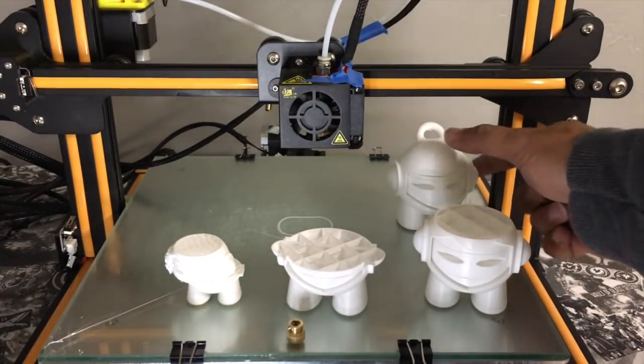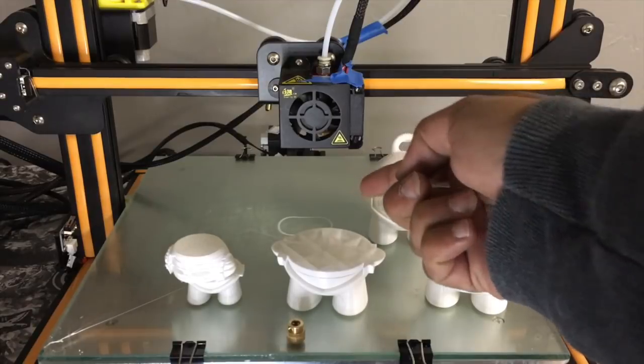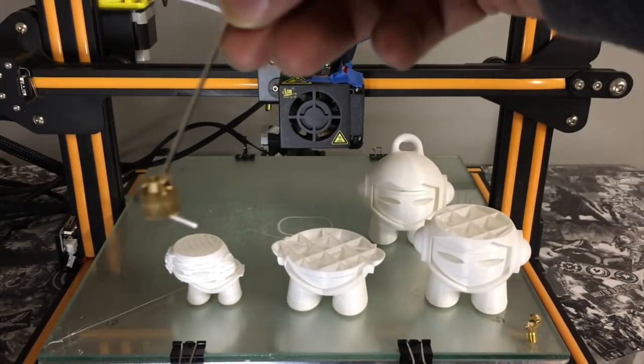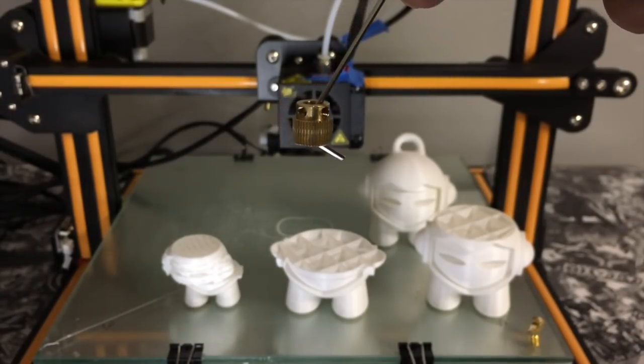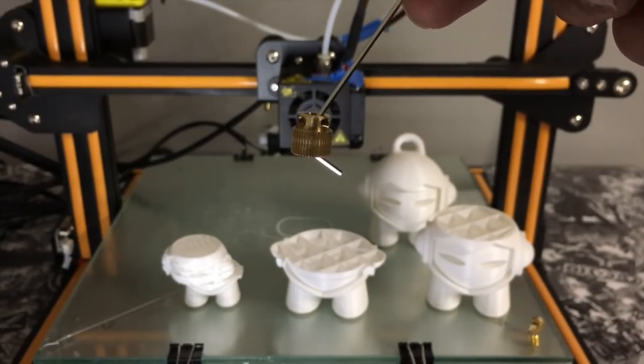Okay, so another thing to watch out for, guys, is when your filament's actually coming out and there's a partial clog on your nozzle, what ends up happening is your filament feeder or filament feeder drive. Some people call it a gear, some people call it a pulley, which basically is this one right here. So once the filament is going through, this thing keeps turning like so. Eventually, over a period of time, the teeth on these actually wear out. So what ends up happening is, even if you don't have a clog in your nozzle, the gear or pulley here will have trouble feeding the filament through because it doesn't get a good grip on it. So this could be another reason